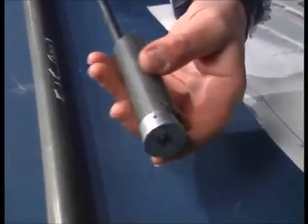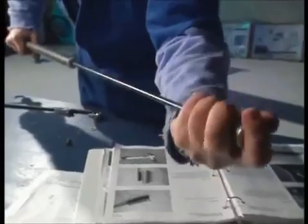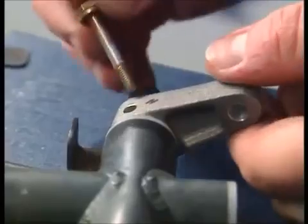Got to attach the throttle grip sleeve onto the end plug — that's just held in with a roll pin. It's pre-drilled, so it slots in there, a little roll pin in the top, and then gently give it a bit of a bash. There we go, sorted. The whole shaft then fits down the length of the collective handle. It's a little bit stiff because it's still covered in its protective layers — strip that off and it'll rust quickly — so just a little squeeze down for now. Then put another one of these B control arms on, bolt through, and nut on the other side.